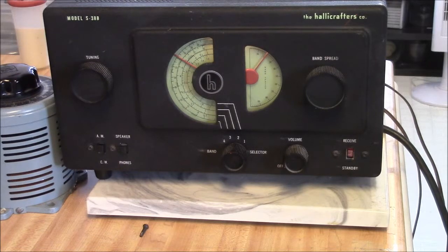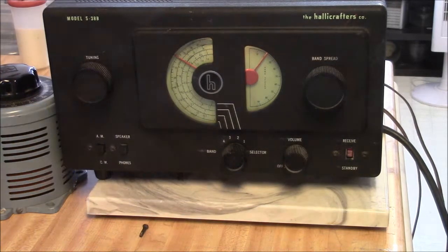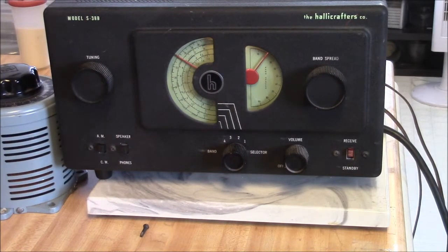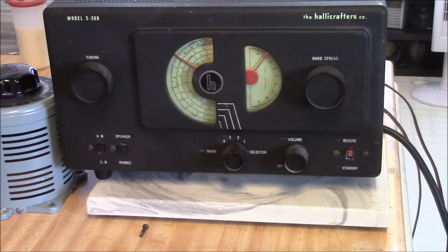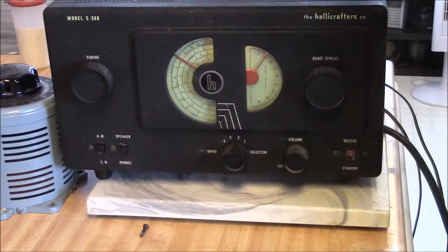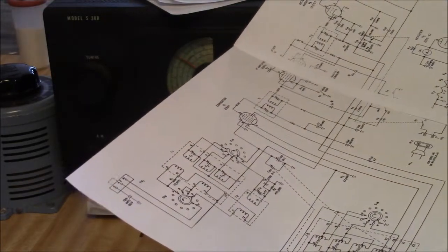It appears to be kind of more of a feedback circuit on one of the IF tubes — actually the IF tube. If you want to look at the schematic, there's a link below. My page is kind of broken in half, it's kind of weird. Something about sideband — they ground something. In the schematic it's near V2, and it's a 12SK7, not a 12SA7. I guessed wrong.